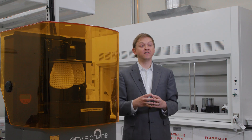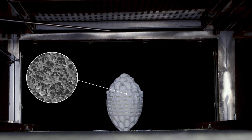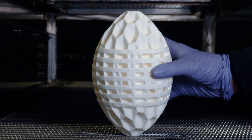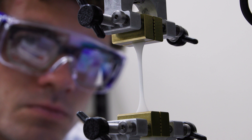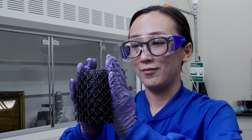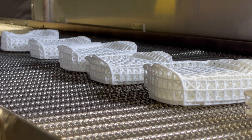FreeFoam belongs to the DuraChain class of materials. DuraChain materials undergo a process called photo-PIPS, or polymerization induced phase separation. This ability lets you control the in-situ forces during foaming to provide unparalleled stability, accuracy, and dimensional tolerance — enabling very unique properties that allow 3D printing to be used for functional end parts and products.